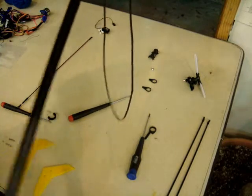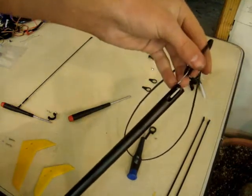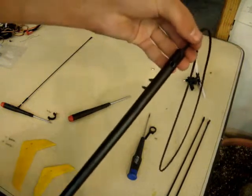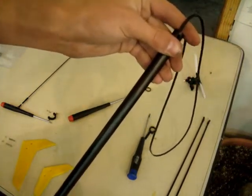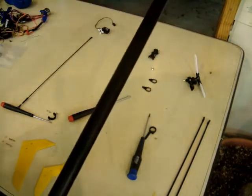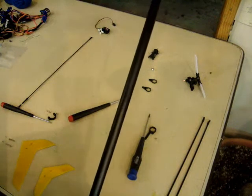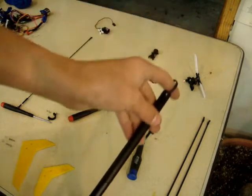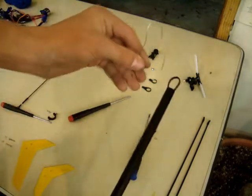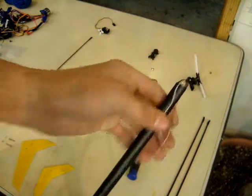Take your wire. With the belt, you're going to want to have the oval-shaped hole facing out. Then take your belt and make sure it goes in the hole so it goes around this way. Pull it through, putting your finger here so it doesn't twist, and pull it towards the end so you have it sticking out both ends. Now look through it to make sure there's no twisting of your belt, because any twisting will really mess this up. Take your finger out of the hole with the long slot. I have a piece of wire bent into a U-shape that I can stick in here, and all this does is hold the belt at the end.